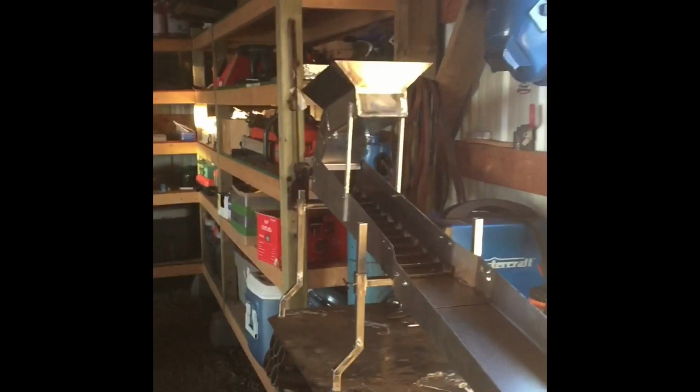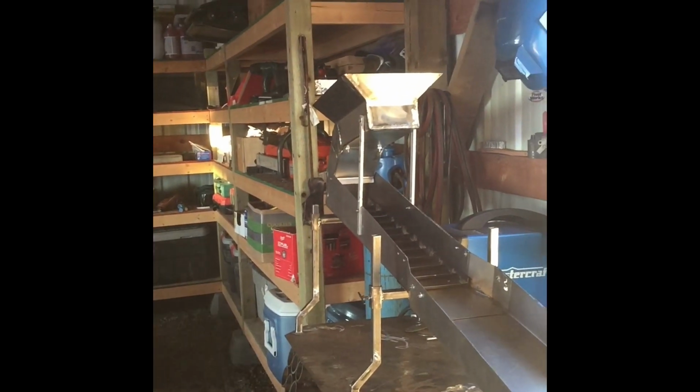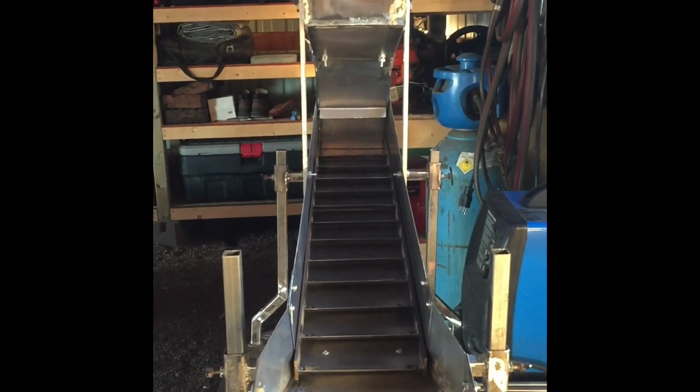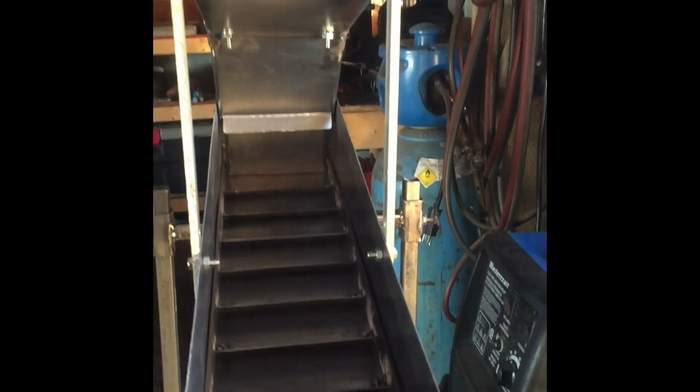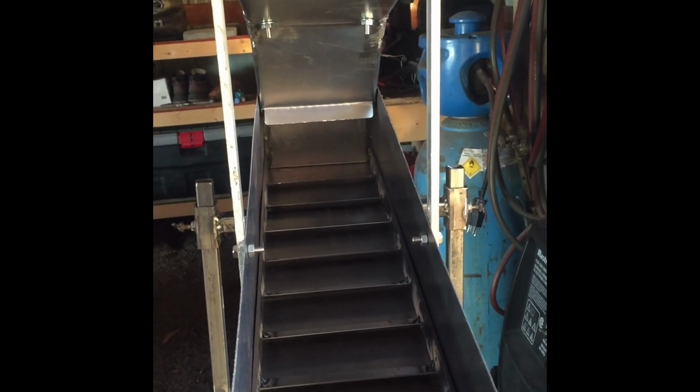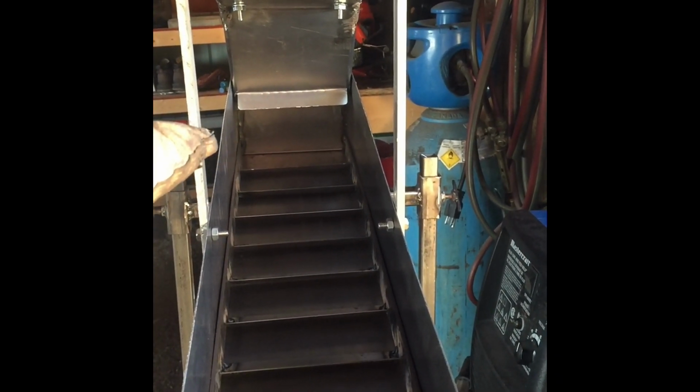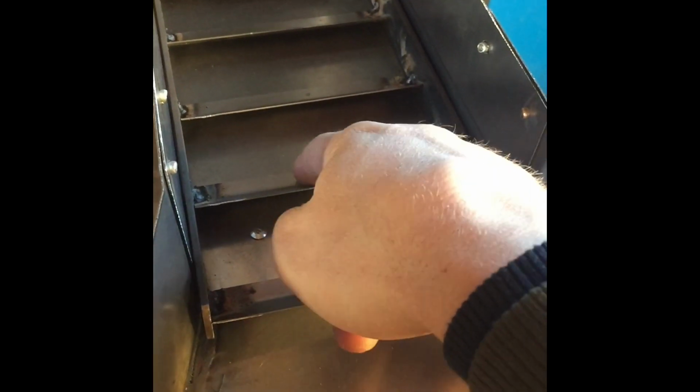Another day done. I got the legs all built, frame welded out, and the riffles for the top section more or less finished off. I got to find some way to grind the back a little bit so it's a little bit looser fit going in, and then figure out some pieces to weld on there so I can jam it tight into the back and then pull the front down. And I was kind of thinking like a carriage bolt or something just on this one riffle to seal it down to the miner's moss.